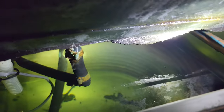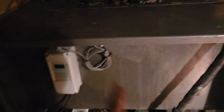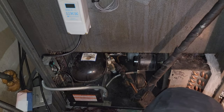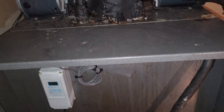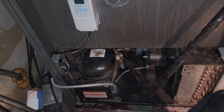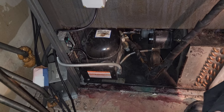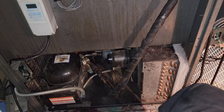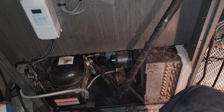There's too much water in the glycol. You can see it's all the way around. That ice starts to act as an insulator, makes it struggle to bring the glycol temperature down — it's a vicious circle. This unit already struggles. There's a box fan bringing air from outside because it's just an old R22 unit. We put a compressor back in it in 2017, but I bet this unit's from 2004. It's just beat down.